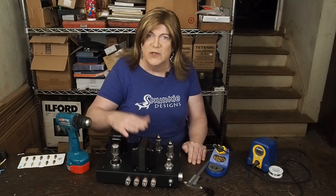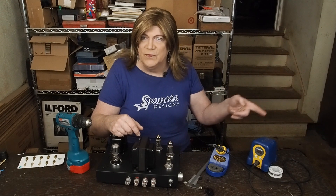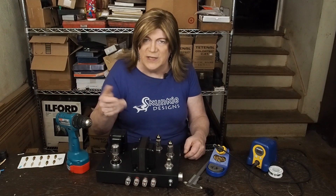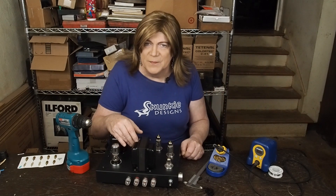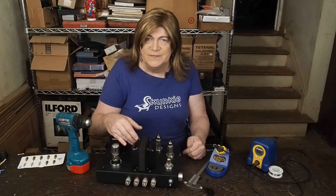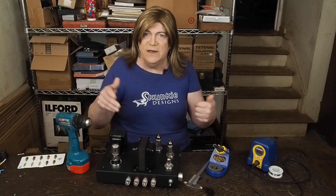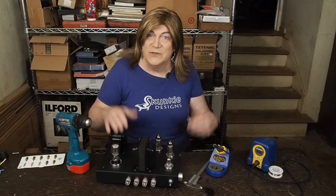If you're going to run a tube amp, I'd highly recommend getting one of those. If he had had one with his stuff plugged into it, it wouldn't have killed his amp. Hopefully we're going to be able to fix it with some resistors that were sized right so they acted like fuses before it killed the output transformer — but that's for a future video. Anyway, just wanted to talk about my take on these power conditioners and what you need to do to feed good power to your tube amps to keep them safe.